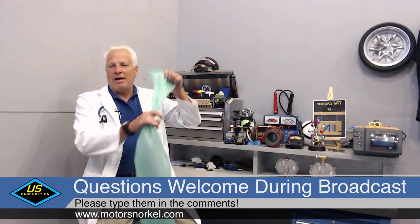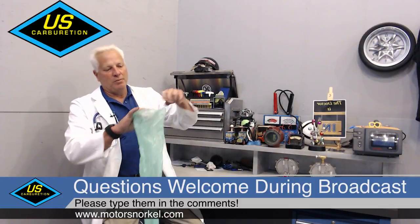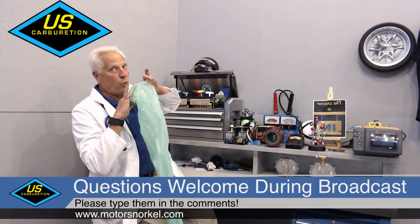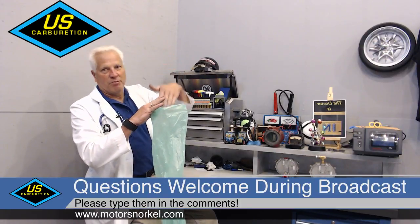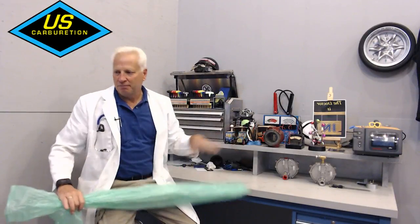But that's a Bernoulli bag. How's that work? Well, when you hold that end open like that and you blow from here, negative pressure is created here and the atmosphere actually helps blow it up. So you get the help of the atmosphere. And I always like to talk about Bernoulli because it's how our systems work, how carburetors work, how alternative fuel works. And so it's good to understand Bernoulli. Bernoulli's everywhere.